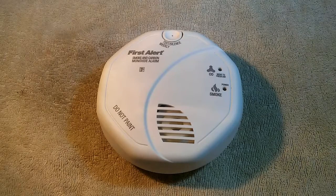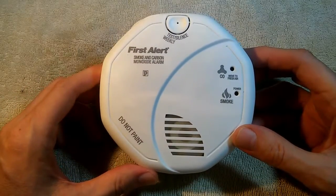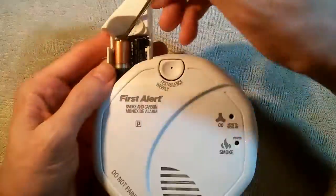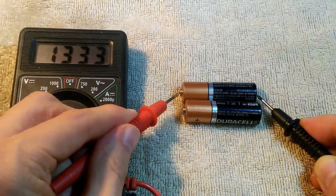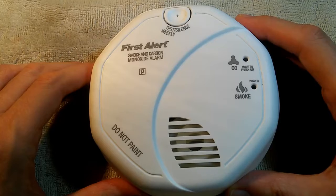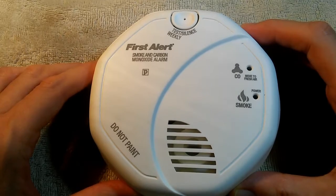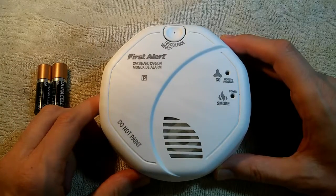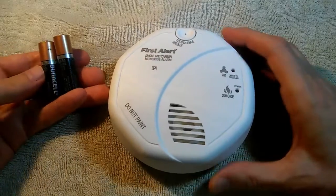It's been 110 days since we recharged the batteries, and now the smoke alarm is chirping again, indicating that the batteries have run down. We're going to pull these batteries and check the voltage: 1.34 and 1.33 — pretty much the same as before. So when the batteries were fresh, they powered the smoke alarm for 713 days. After the recharging, it powered the smoke alarm for only 110 days. That's only 15% as long. Therefore, using the assumption that the length of time is proportionate to the amount of energy density stored, we were able to restore only 15% of the energy to these batteries by recharging them, even though they showed a normal voltage.